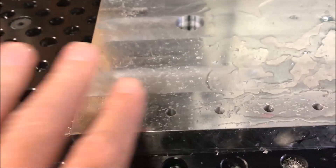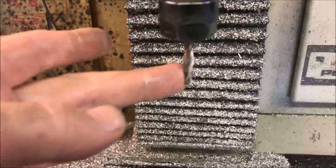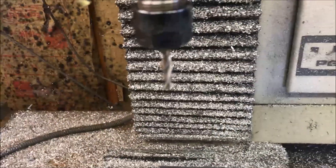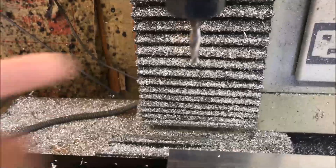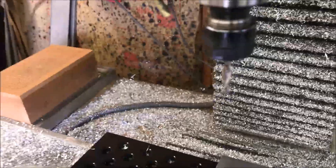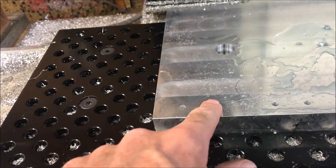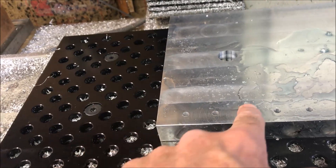I got through all those holes but it was running kind of rough. This drill has been drilling a lot of steel — I've just been using the same drill bit, which could have done like 300 holes in steel for all I know. So I'm going to put a new drill bit in and slow it down a little bit. I think I'm at 12 or 13 inches per minute — maybe I'll drop it down to 8.